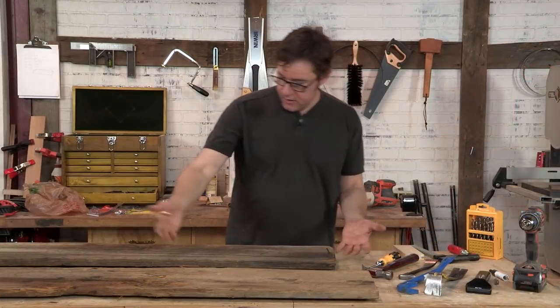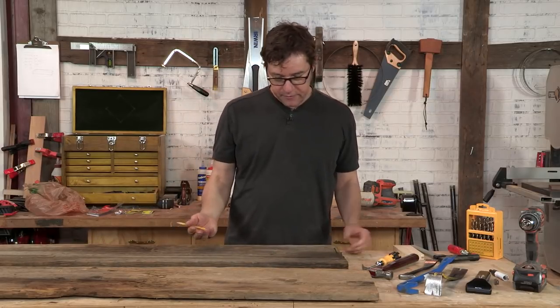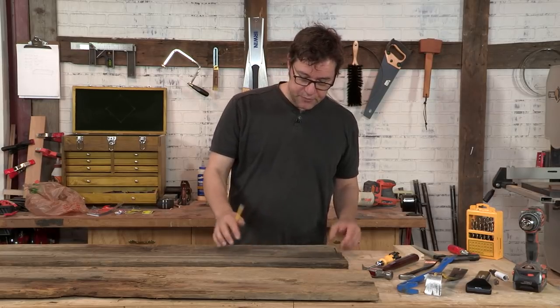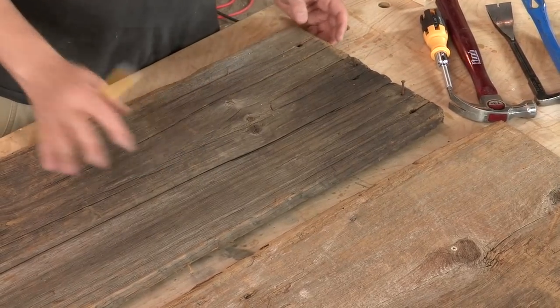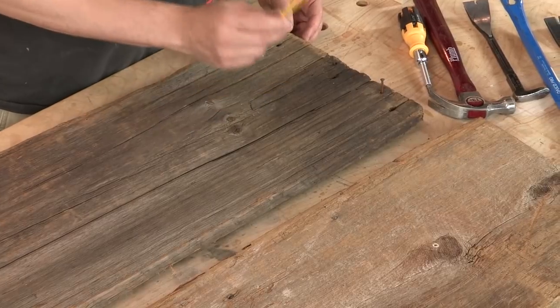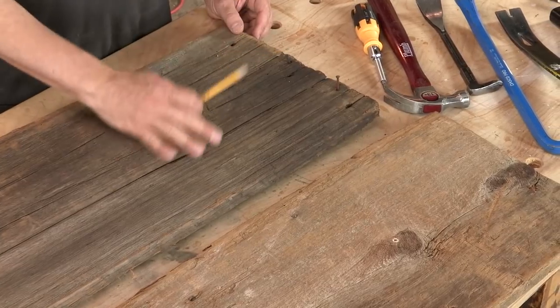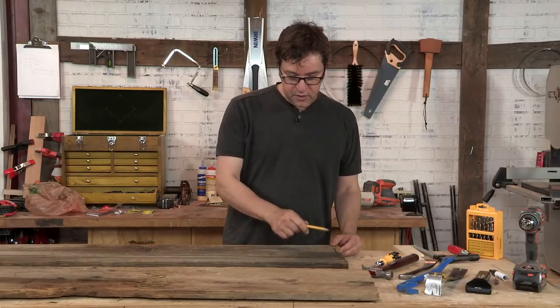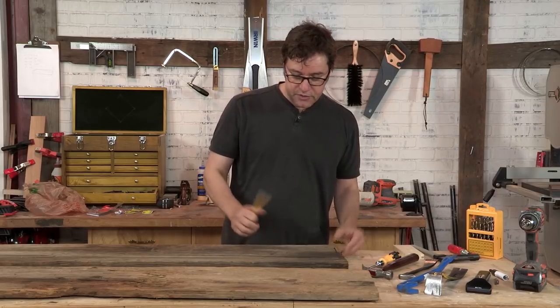When we look at a board like this, probably extracted from an old barn that has all the hallmarks of reclaimed material — it has this beautiful surface patina. Even if we want to preserve the surface patina for our next project, whether it's furniture or cladding of a wall, we still have to take care of those nails and maybe a screw here. If we want to process this board, not just install it in the house, we definitely need to take out that metal hardware. Otherwise, they're going to make damage to our saws, joiners, planers, and other tools that we use to process the wood.